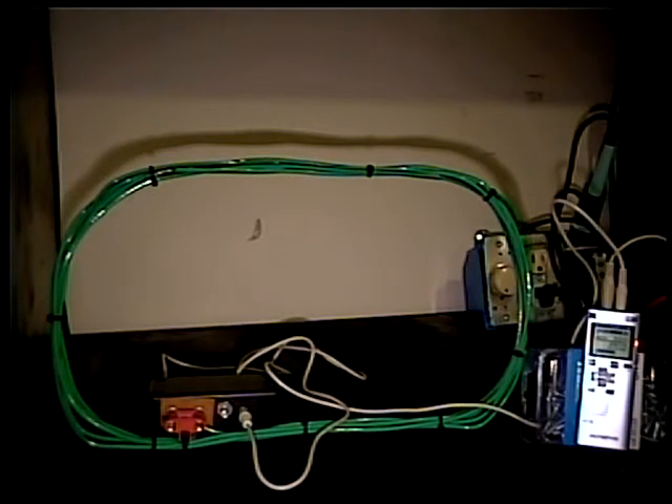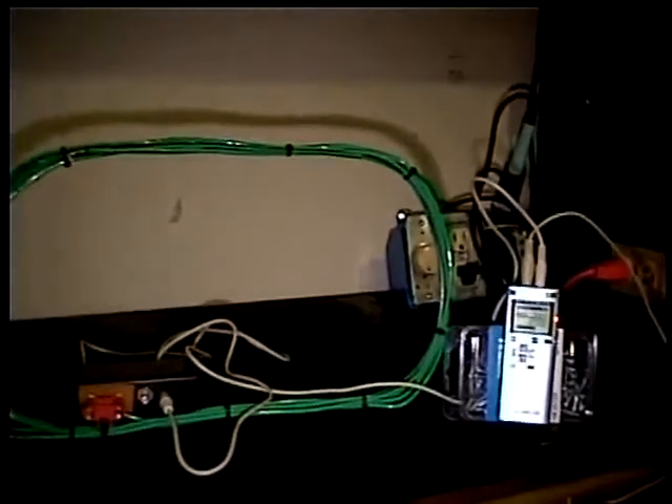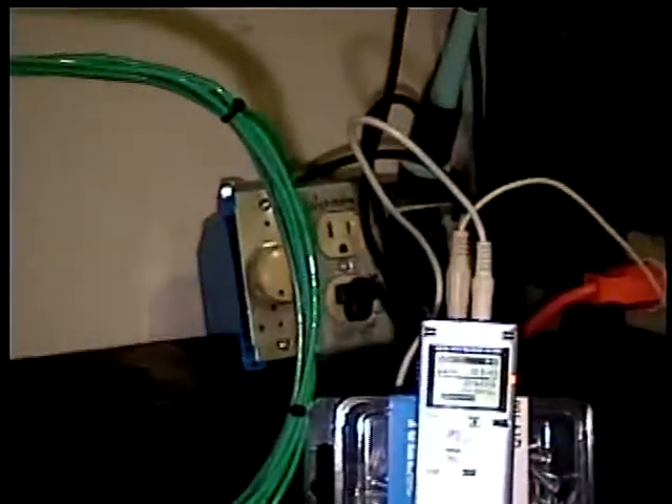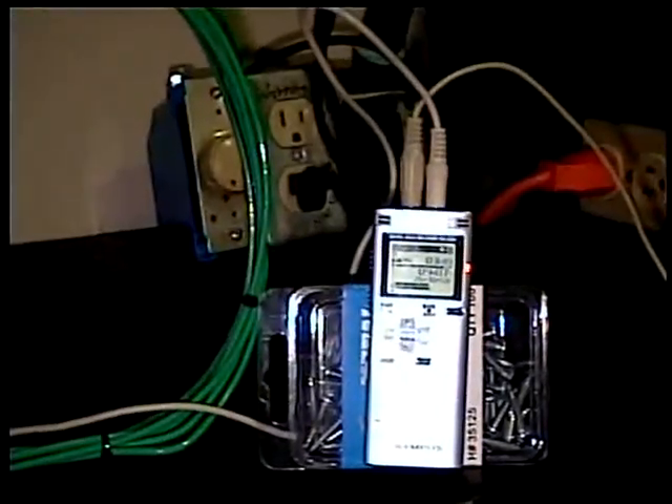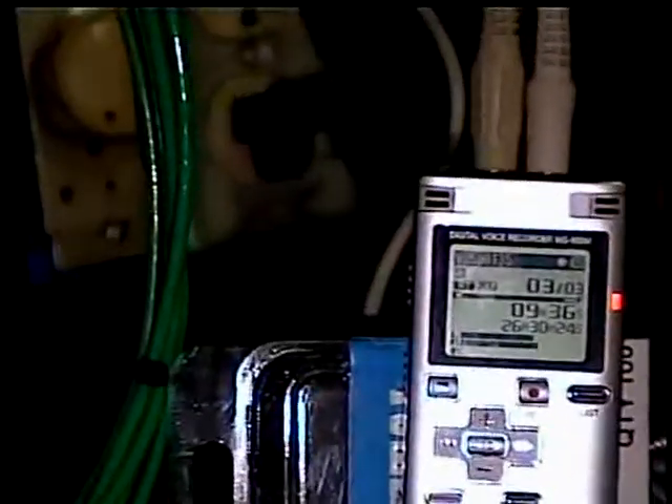I seem to be getting a lot of level indication on the recorder for the small amount of volume I have, so I'm thinking it's probably some form of out-of-band ultrasonic frequency being picked up. I wouldn't really be surprised because I'm using a flat-screen monitor right above to monitor my video. This 22-inch monitor isn't like a CRT — it doesn't generate as much magnetic interference in the audio spectrum, but I'm not sure what it's going to do in the above-audio spectrum.